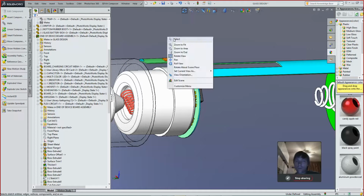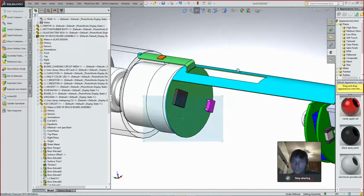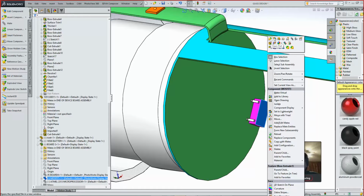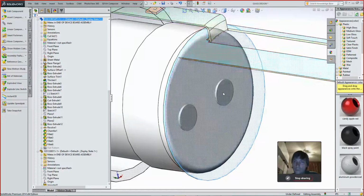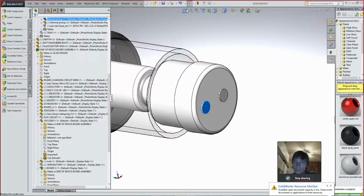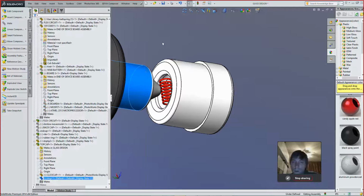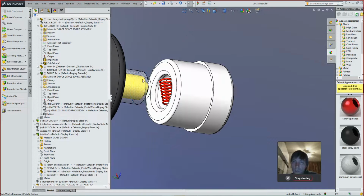And so if we take a look at our ceramics for a second here, what we're going to do, let me hide this chip. Yeah, you pull those components out. All right, here I'm going to hide the flex circuit. Here are these aluminum contacts here, and our heating element is buried up inside of here. So let's take a look at this. There's the connection for the coil. If you can remove the ceramic or some of those extra layers, that would show the legs of the coil.